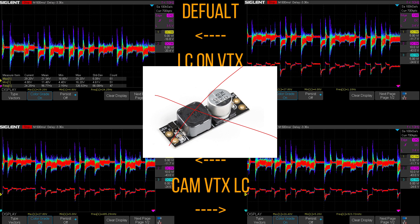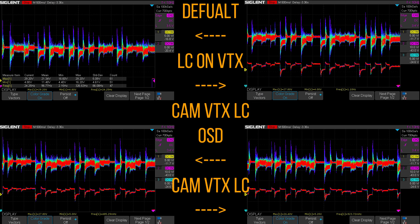I've been getting a lot of emails and comments about testing diodes and whether they'd be better. But you need to consider the dropout voltage of a diode - you could have a 1 volt dropout in some cases, which means if your battery is at 16.8 volts and you add diodes by your ESCs, your ESCs are only getting 15.8 volts. That 1 volt really counts for your KV - you're losing efficiency, power, and speed. A low ESR capacitor is better than a diode. I did order diodes and I'm waiting for them to arrive to test this.